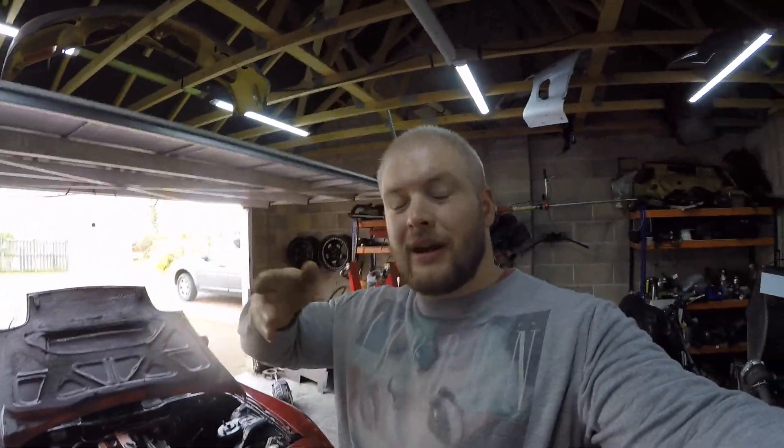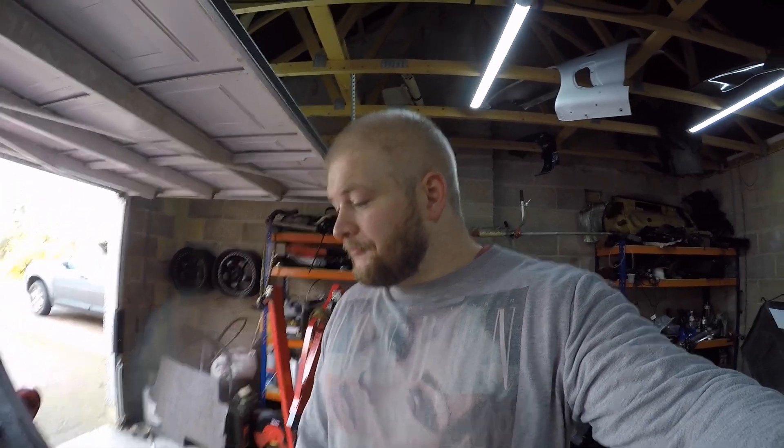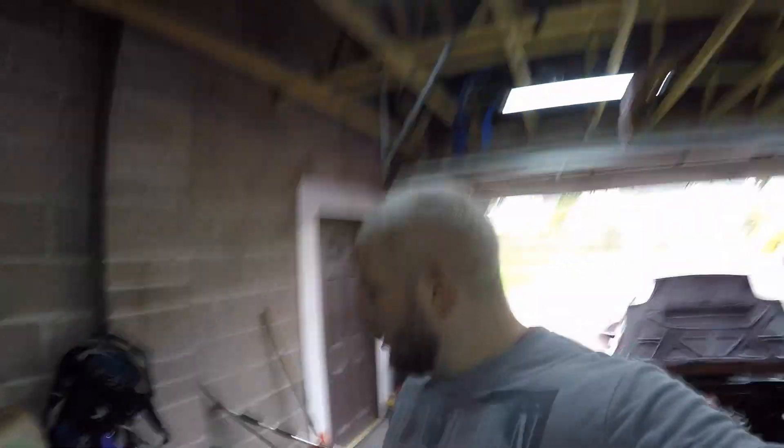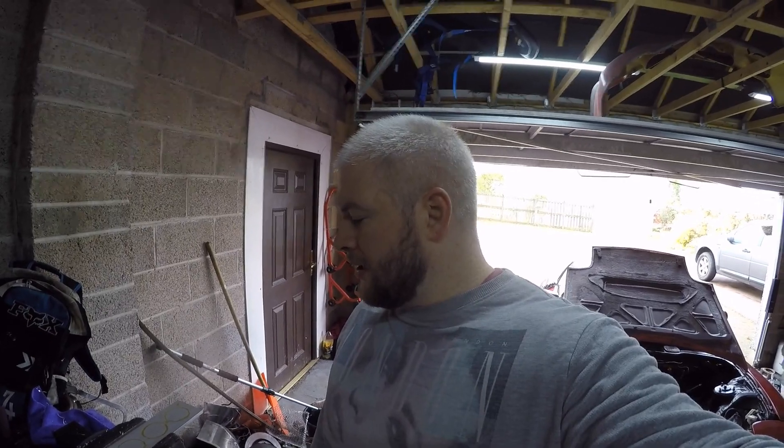Once we bore it out I'll be able to do fine adjustments. I don't mind a little bit of a gap around the outside, because when I chamfer it and weld it, it'll be a better weld — more penetration on both sides. That way I'll be able to port it and still have plenty of meat to weld onto. Anyway, I'm going to carry on with my holes — they're ovals.